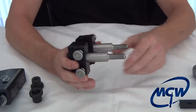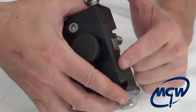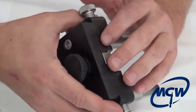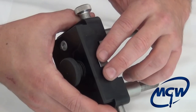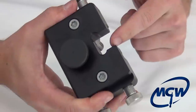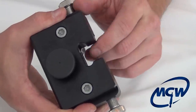Put a little pressure on it and flip it over. Now this side — if you'll notice — does not have any type of relief cut. This is the side of the tool you'll use for probably 90% of all installation and adjustments. It has enough clearance on the main carriage to do front and rear sights, but this is the side you want for all rear sights. The mirror image of this bracket has a very deep relief cut — this is for slides that have a very large recoil spring underlug dust cover, to allow you to reach the front sight.